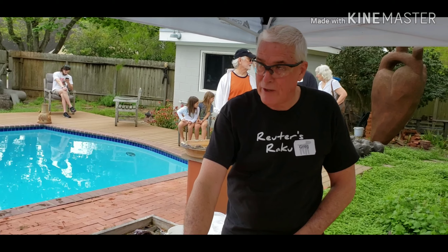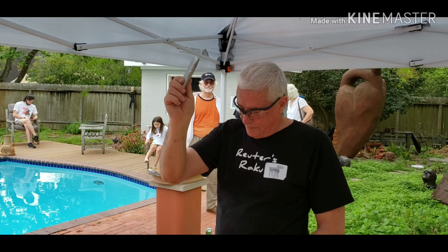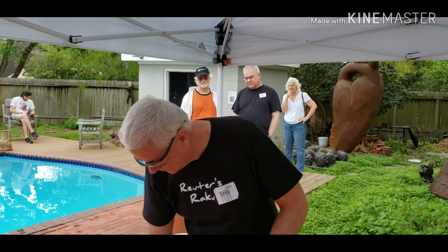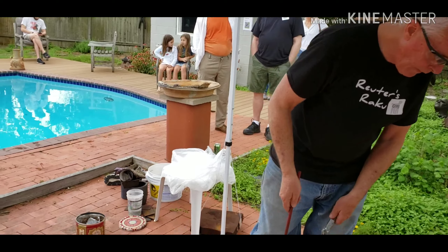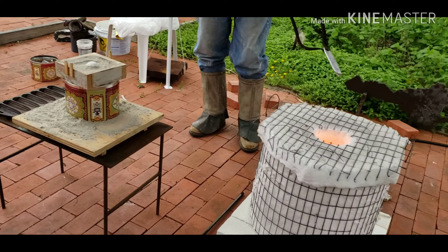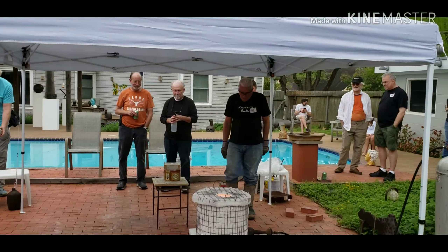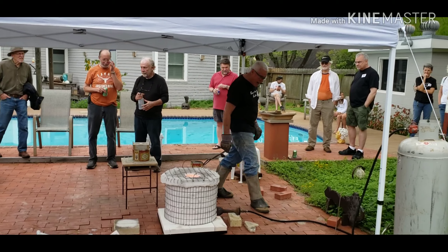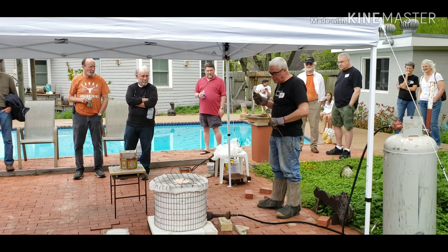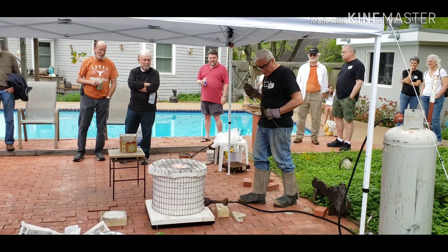Any metal left over, I'll pour from this into the biscuit mold, and this is what we'll end up with — I call this an ingot. This is how I make my ingots. I'm going to put this ingot in there and I think we'll have enough. So if you've looked at it, it's all melted. Now, how do you tell when it's ready? You stir it up with a piece of steel, and if it doesn't stick to it, it's hot enough. It's a moment of truth.